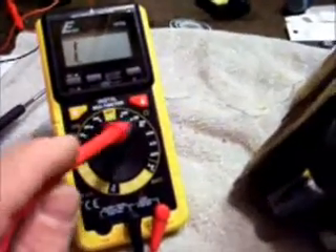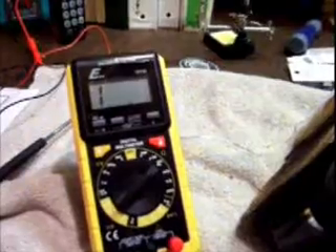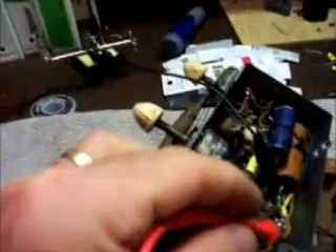We don't want that lead touching the chassis because it obviously doesn't go to ground — it goes to the positive side of the electrolytic capacitors and traces back to the rectifier socket, so it had hot voltage on it and was grounding out to the chassis. I pulled it out and tested it. Set my meter to the two-megaohm range — well, that ain't anywhere near where it's supposed to be, it's pretty much dead shorted. Drop down to 200 kilohm range — reads 1.3, which doesn't seem right. So I go over to where the new resistor is, soldered to the electrolytic lead.